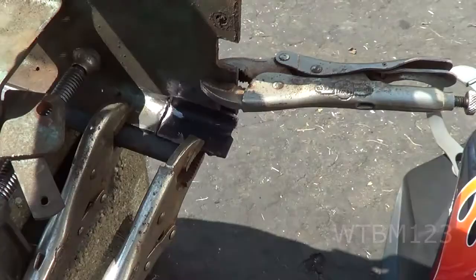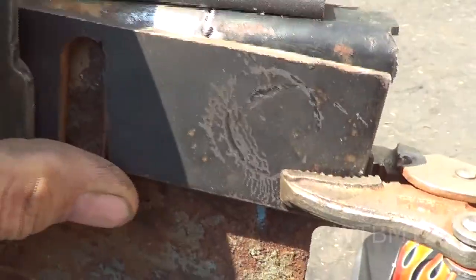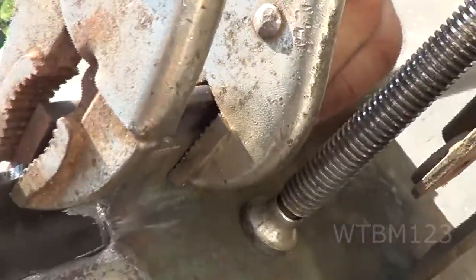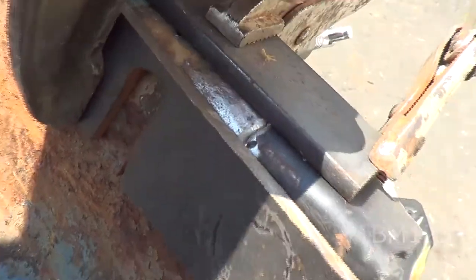It's not exactly the same thickness, so what I've done so I can do this without knocking it apart — I clamped this straight piece of metal on the top just so when it comes across here it helps hold them straight, same as this one here. It's just to line it up, then I know the top's good and fairly straight.